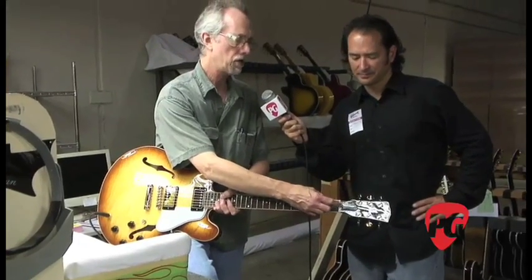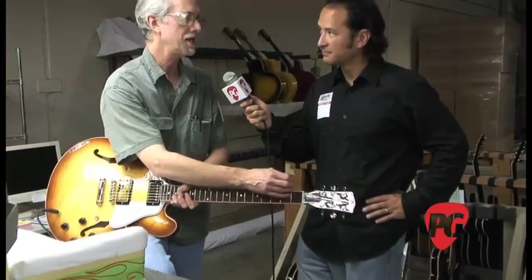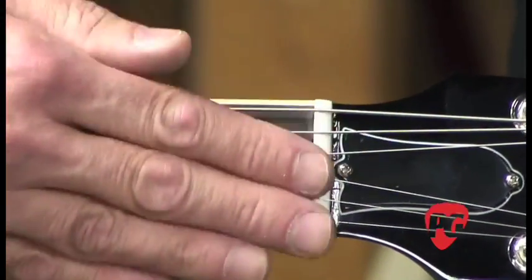Then you have to go up here and you have to check to see how they've shaped the nut. As it comes off of the Plek machine, it's rather rough looking, so you have to take some additional material off of it and you have to clean it up and smooth it out and not shine it all up nice and pretty.